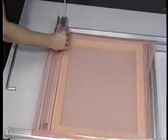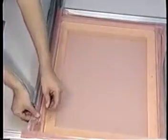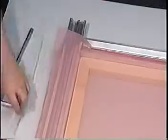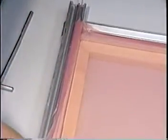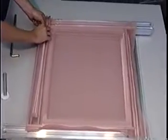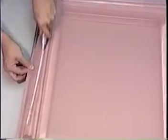There are two types of locking systems available in the Tension Quick: keystone or top loading double nylon. The keystone locking system uses a single nylon rod on each side that is extruded in a taper. The keystone rod is slid in the end of the roller with a groove similar in shape to the rod. The newest of the locking systems, top loading, uses two round nylon rods which are snapped into the locking groove with the assistance of a wheel type insertion tool.